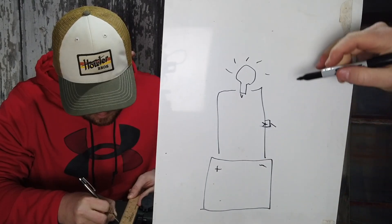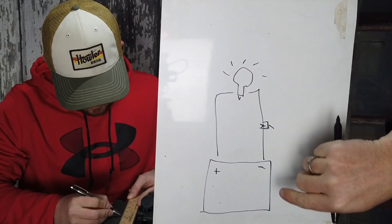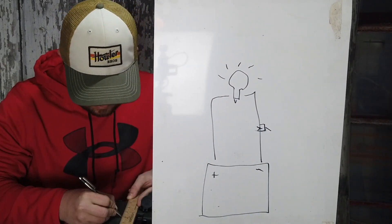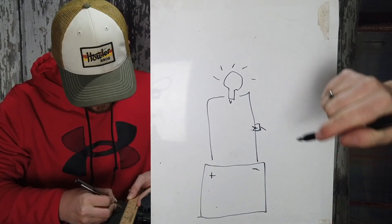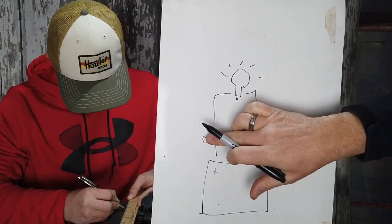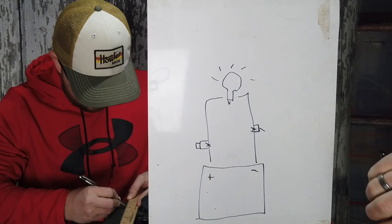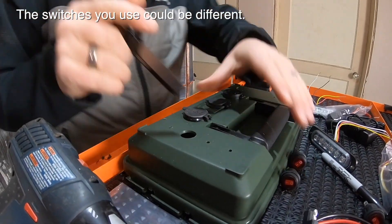That's all this box is doing. It doesn't matter if it's going to be a light source like the LEDs or if it's going to be terminals that give power — you don't want to leave them on all the time because they are drawing voltage to convert down from 12 volts to 5 volts or whatever it may be. On the positive side, we are going to put a fuse that will interrupt there. Power will go through the fuse, and if there's ever a short or too much draw, it'll blow that fuse before it burns up the battery or sets something on fire. These switches have an alignment notch — you can either notch the plastic on the side or cut the alignment notch off and the switch can go anywhere, but the notch keeps it from twisting.